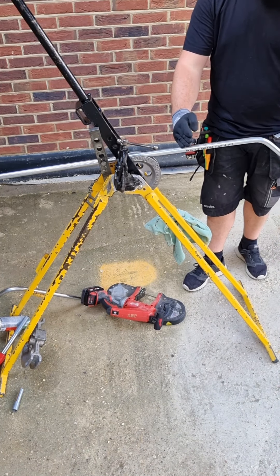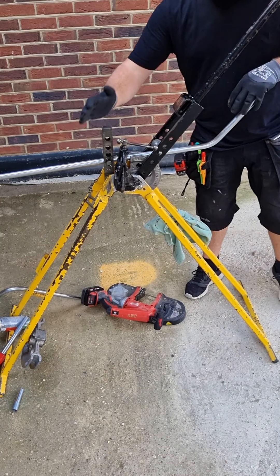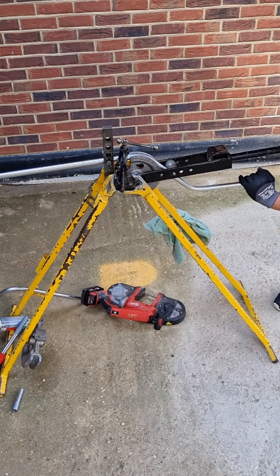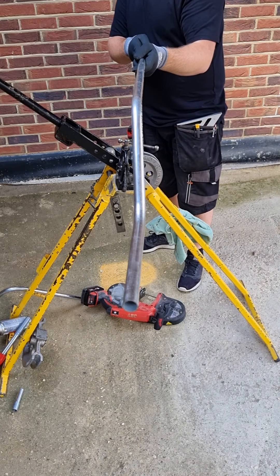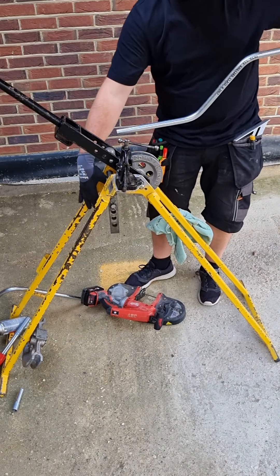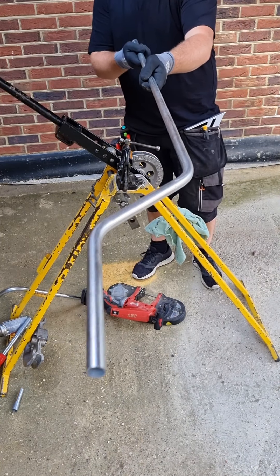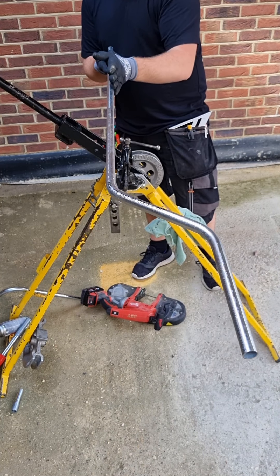So for a piece of conduit, you'll figure out what the next bend needs to be. Keep the piece nice and straight and bend it down. You only need to bend it back to that line you had. Now the set should be a little bit wonky — the bars should be parallel to one another. It's better to do a little bit less than too much. That looks better — a little bit wonky, but the actual set is now parallel.